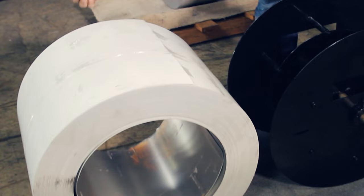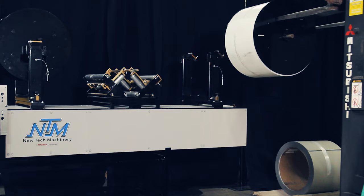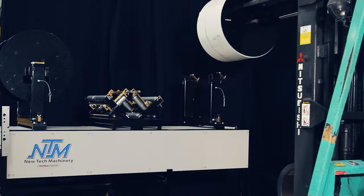When it comes to types of materials, the Mach 2 can form 30 gauge to 24 gauge painted, galvalume, and coated galvanized steel. You can also run between 0.019 inch and 0.032 inch painted aluminum, and 16 to 20 ounce ¾ hard copper. You may need to make limited adjustments when switching materials.